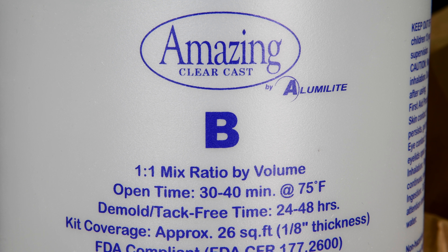Do not quote me on this, but as far as I know Alumilite Light comes in at least four different ways: there's the regular Alumilite Light that gives you about four or five minutes working time and then you've got to get it in the pressure pot right away — it'll be ready to demold in about half an hour. Then there's Alumilite Light Slow which gives you about 10 minutes working time. And then there's Alumilite Light White, which will cure white, which might actually be kind of handy at times. And then there's this version.